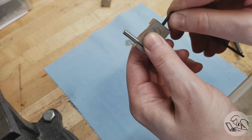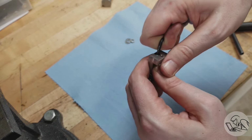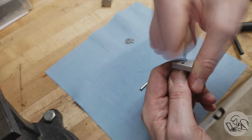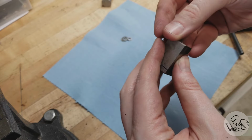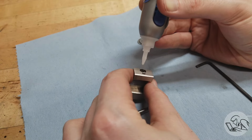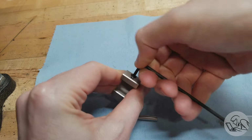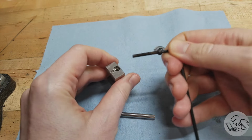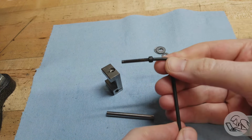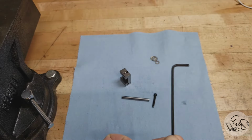So, okay, yeah, that's clamping the bar. But after a couple of loosening and tightening cycles, it got stuck. It wouldn't come out, it wouldn't unthread, and it was thoroughly wedged in there. So, did I just scrap this part by getting a bolt stuck in it? I said a prayer to Metallic Ore, the god of machining, and I tried super gluing an Allen key in there, let it set up nice and strong, and it worked. It came out. Whew. Boy, that was scary. And a little bit of heat from the torch separated the wrench, and we're back in business.